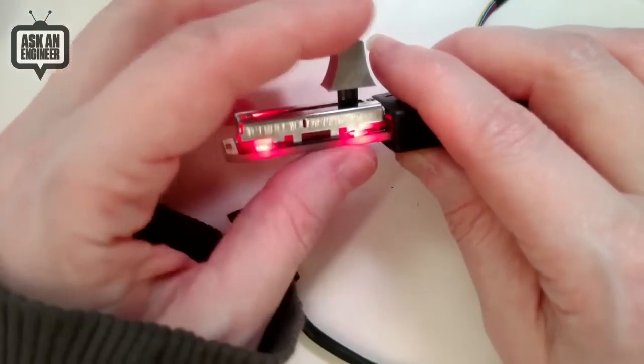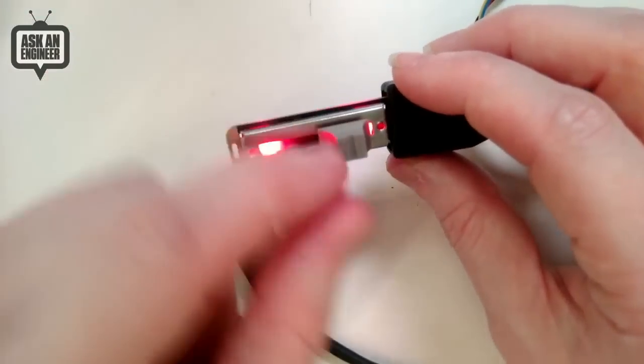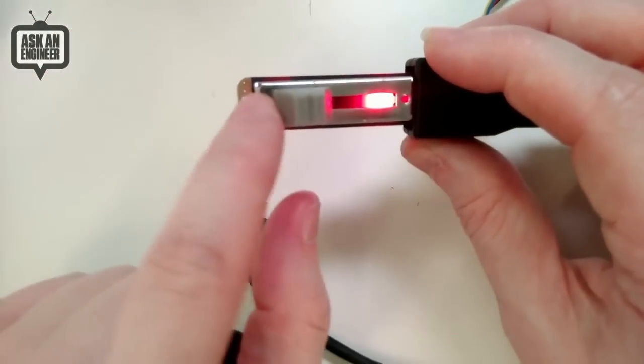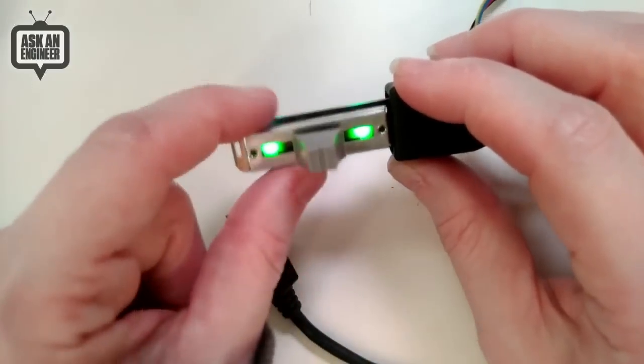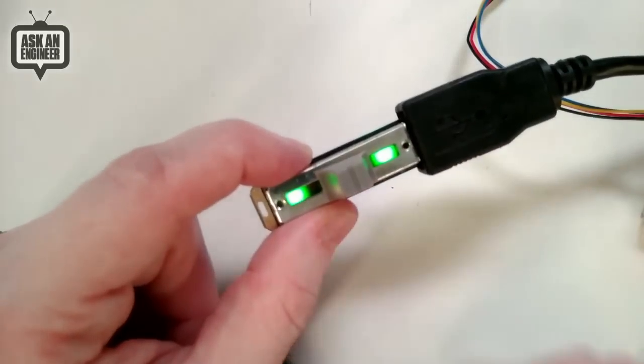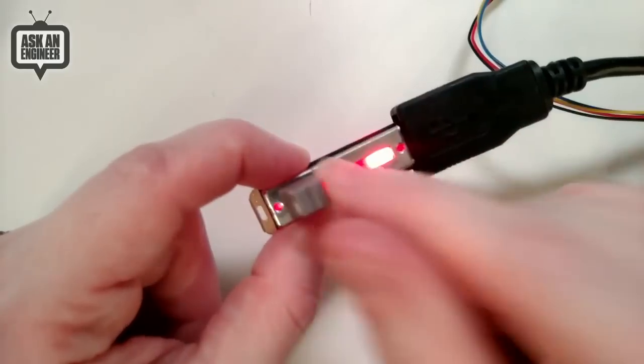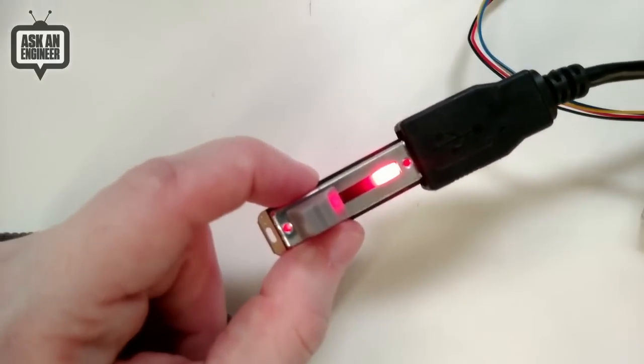It's just a trade-off. You're not going to get full resolution on every color, but it's fine for notification. And then you can program it as an HID device. I actually had it hooked up to my Philips Hue lights. I would read the value of the potentiometer with my desktop and use it to dim or raise the lights in the entire house, which is kind of cool.